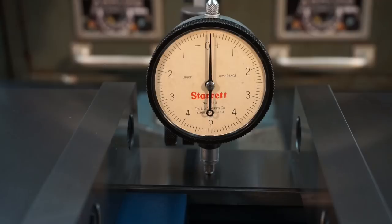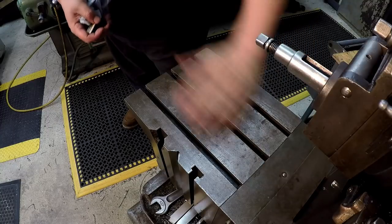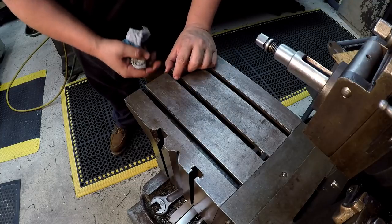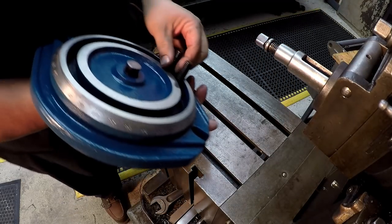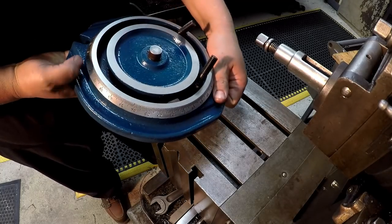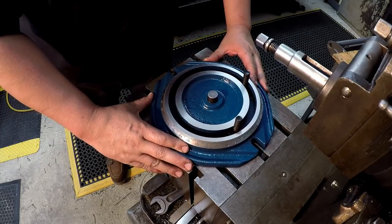Hopefully you enjoyed that — I'm feeling pretty good about the measurements we're getting. I want to go ahead and start getting this thing mounted up. Got our table cleaned off good. We'll use the middle T-slots right here and a couple T-nuts — I had to mill them a little bit to fit in there. Going to get our swivel base set down. I've already got the T-bolts stuck in there — that's what the little cast slots are for on the back side. I want to make sure that the zero is on the front right here. That's going to be a good fit right there.